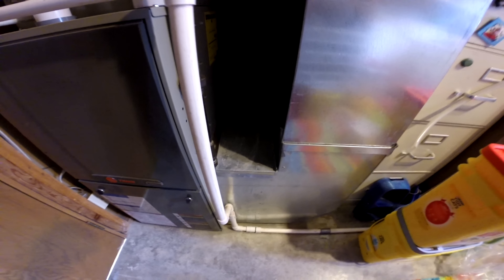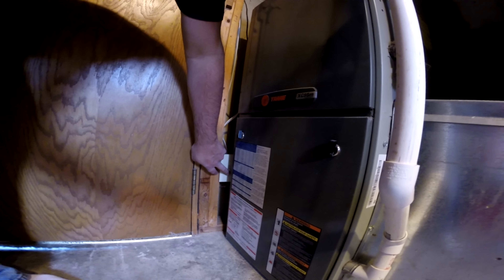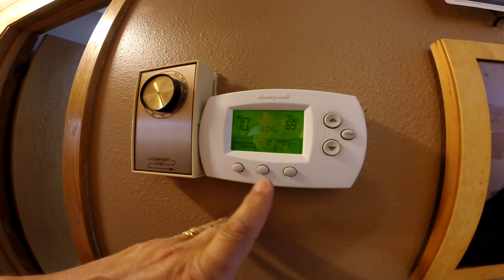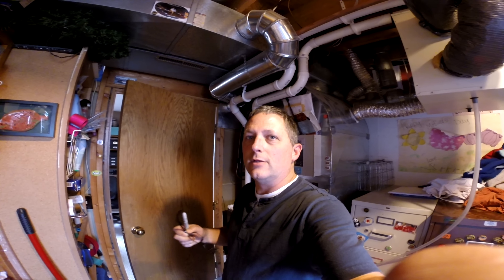People in your household will hear that through the vents and they'll think, "He's really working hard to maintain our furnace." It's in place. Simply turn it back on. Now that you've installed the new filter, you can turn your furnace back on and then turn the fan to on. I always have my fan circulating, which is why I need to change the filter more often. Also, do not ever buy a house until you have the furnace inspected. And if the inspector finds a problem, have the current owner get that fixed before you offer to buy the house, or you can write it as a contingency in your offer. When I look at a house, I pull the filter out and take a look at it. Forced air runs whether it's an air conditioner or a furnace — it runs through the filter. The filter takes out the things that would otherwise wreck your furnace fan, and your furnace will be a lot more efficient.